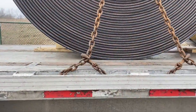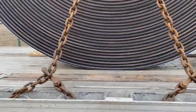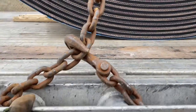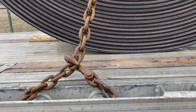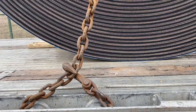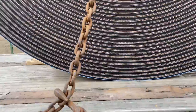I just came back and fixed the chain. I wanted to show you what these look like and how I'm actually hooking them to the rub rail. I use two little spools inside my rub rail — if you use one, your rating drops down to 2,500 pounds on most trailers. I'm using two, so now my rating is right at about 5,000 pounds.